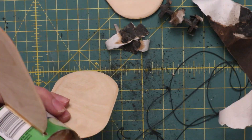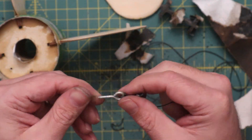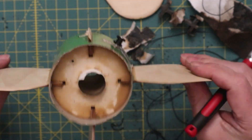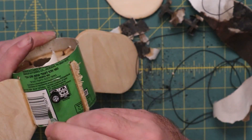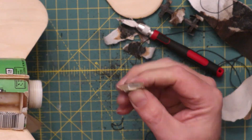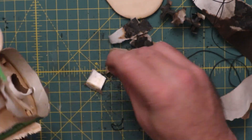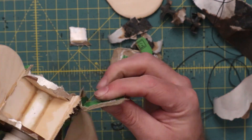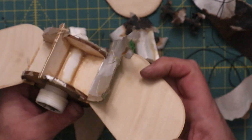We're going to go through and salvage the eye bolt, then do a destructive test to see how well these construction methods worked out — what their breaking point is and what we can learn about doing it better next time. We're going to cut a window out, take the rail button off, and then see what the internal fillets look like. Check for adhesion — see if when we slid the fin can up we got even distribution of the glue and how much peel strength we have on these attachments.